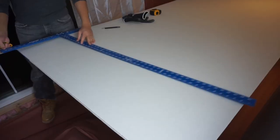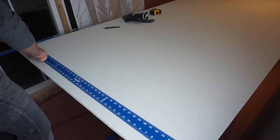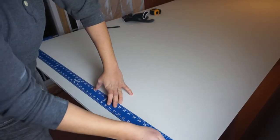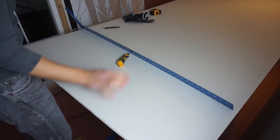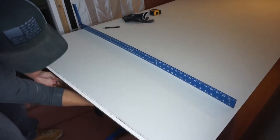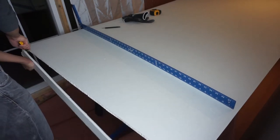All the cracks have been filled, and now what I'm using is a drywall T-square. It's very easy to use — just line it up and score the top of the drywall, then snap it just like this. Take your box knife and score and cut the back side, and it should snap off cleanly.